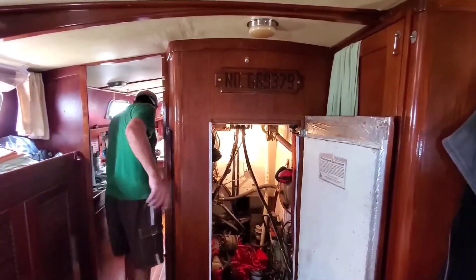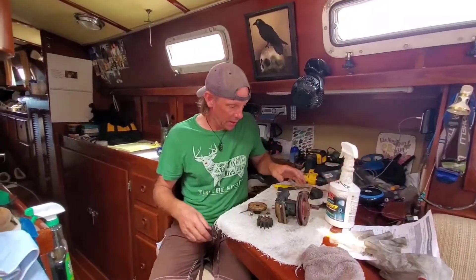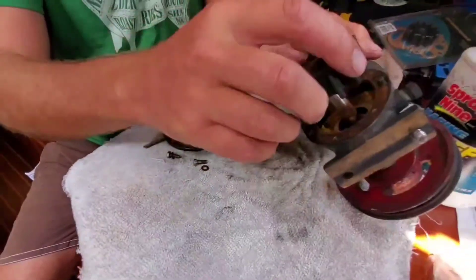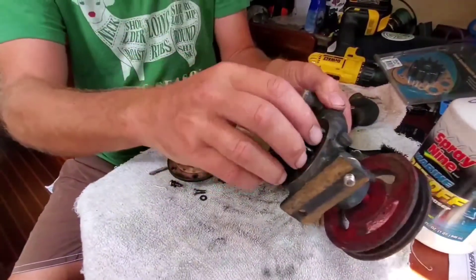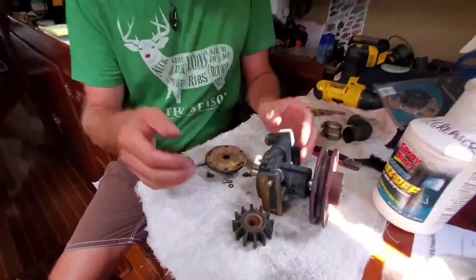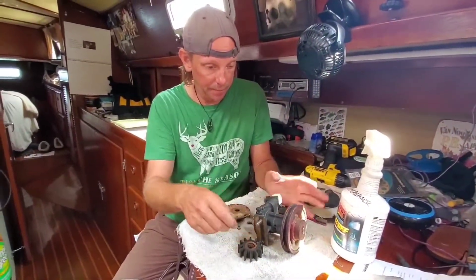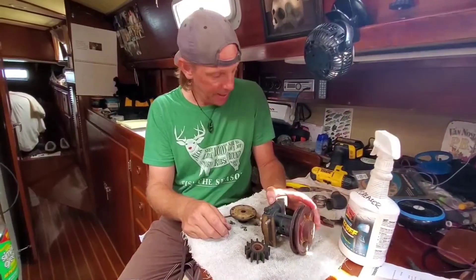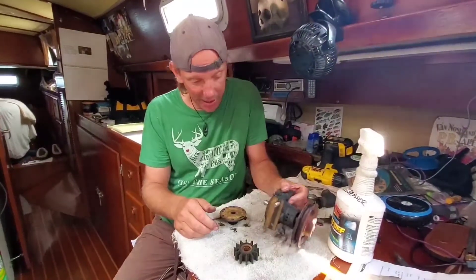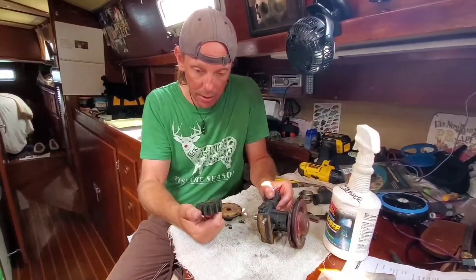The impeller project is over here. We have the impeller taken off — there's a pulley wheel and this is the actual unit itself that goes inside and draws water in from the sea to cool the engine. It's located under the alternator. This is the third of three belts — it's engine driven. We're just kind of learning about it as we go. We got it apart and it looks in pretty good shape, so I'm going to save this one and put a new one in.